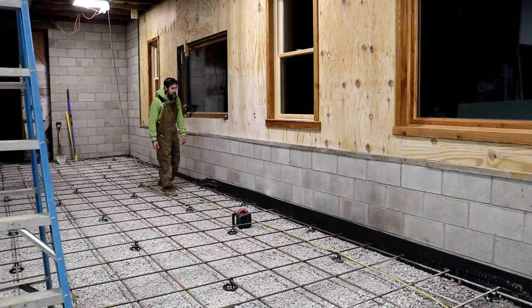The problem is that I don't have anything to screed to on this side, and I can easily see a few guys in here pumping concrete around, this stuff flopping off the wall because it hasn't stuck well to anything that I've tried, and it's just peeling off on its own. So imagine it getting hit with a screed and stuff. I've just decided that I'm not going to use this stuff. I'm going to peel this off, and I've got something that I think will work even better. Give me something to screed to and perfectly serve as an expansion joint as well.